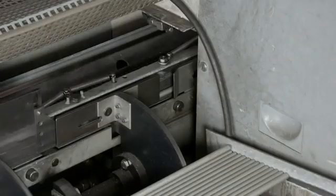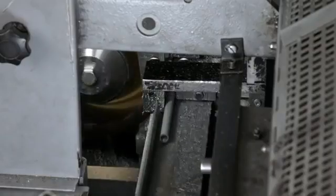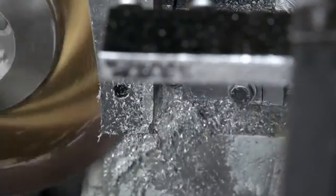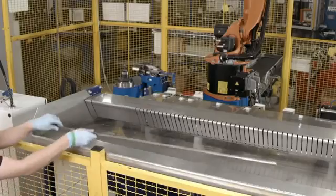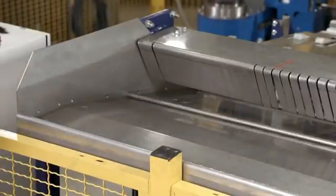At the factory, workers form the heater tube out of lengths of stainless steel tube. A computer-guided saw cuts a tube to the length required for the heater size they're producing. Cars have smaller DEF heaters. Trucks and construction equipment have larger ones.